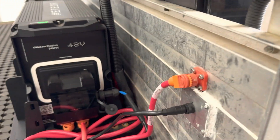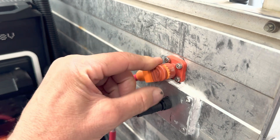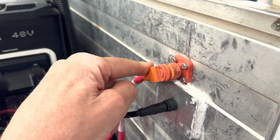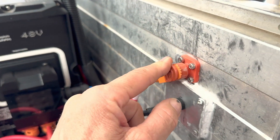Now that's running at 6,000 watts — but just have a look at the cable here. It's tiny. 25 millimeter squared running 6,000 watts through there, because these are 48 volt — and that's the power of 48 volt. If this was 12 volt, there's no way in a million years we could do a project like this.